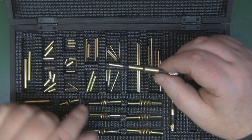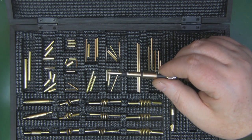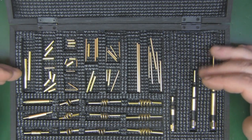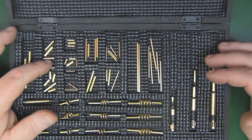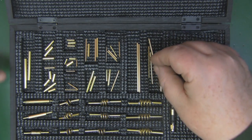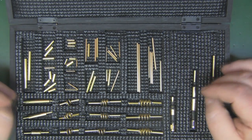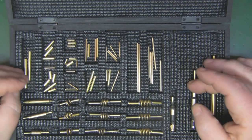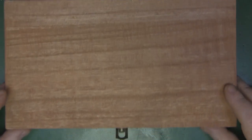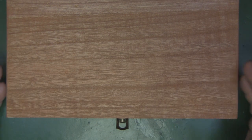2.5 dB, and then we can add some loading coils and other bits and pieces here to make a slightly longer one and more powerful one. And basically the rest of the development kit is just made up of different tubes, brass tubing. It's all made out of brass, and brass solid wire here, different diameters, different lengths, and I've added to this as I've gone along, just playing around with this on the spectrum analyzer myself. And basically that's all it is, and I picked up this nice little wooden box off eBay, and it all fits nicely inside there.